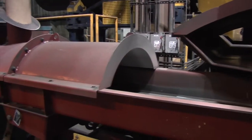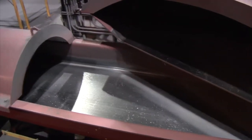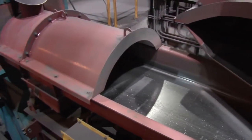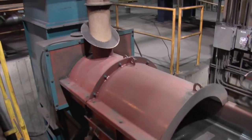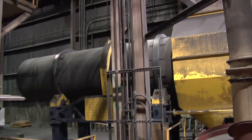At the end of the rotary lump crusher, the sand passes through an eighth inch by eighth inch woven stainless steel screen which separates any metal or foreign debris from the sand. This will allow the sand to pass by while trapping any unwanted material.